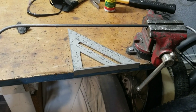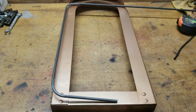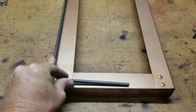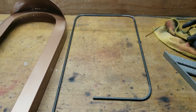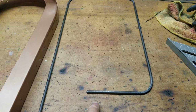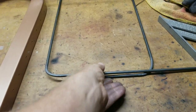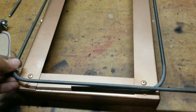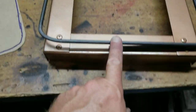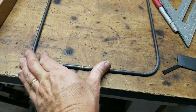18 inches is exactly where it needs to be, but I think if we have a quarter inch under, it won't hit this piece up here on the top. So let's see how this fits — I just have it laying on top and that's actually pretty good. I think that's going to give us plenty of room at the top and the bottom. It's going to look really good, so let's keep on bending. This will be the tricky part — getting this last bend to match up with this one. I think I've got it measured correctly. That's pretty successful. So let's see how this fits on here — we want it to be a little proud of the edges so the bracket tree can fit on there. Yeah, that's going to work out great. So I'll get this trimmed down and welded and we'll fabricate some tabs for the sides. It's trimmed to size and holds together pretty well, so I'll get that welded up.